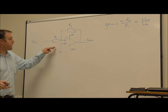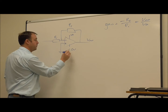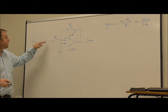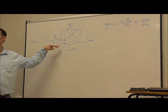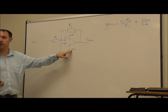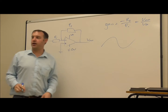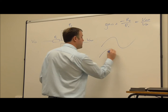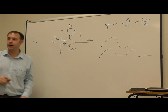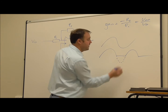Now remembering what would happen here is if that was connected to zero volts as well - let's call it ground - then this output cannot go below zero volts. It can't go below this voltage, and so the output would, instead of giving us an amplified signal, give us a clipped signal. It would hit zero volts and clip off that part of our signal.